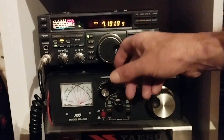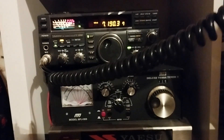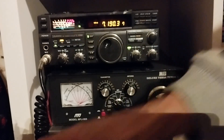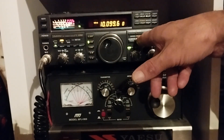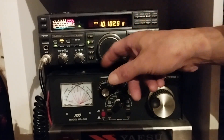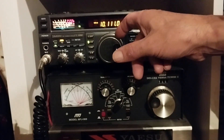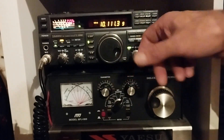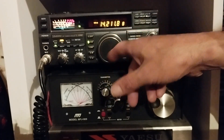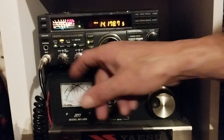Very nice reception. Just to give you a quick whistle so you can check out the SWR — four, four, four. A little bit of movement there but workable. That's on the tuned band. I'm just going to put it on the bypass. Yeah, the reception on that band's good. This band's died off a bit tonight. I'm just going to attenuate slightly — a little bit of noise.